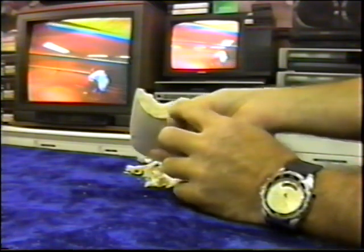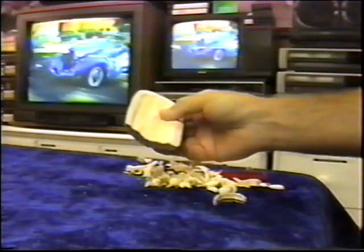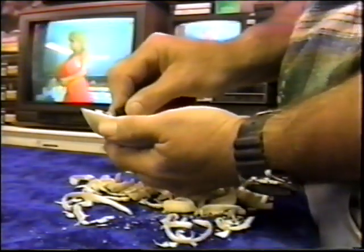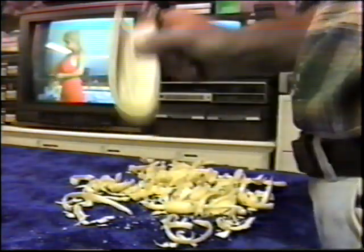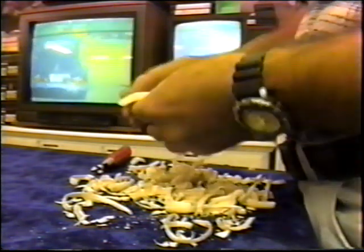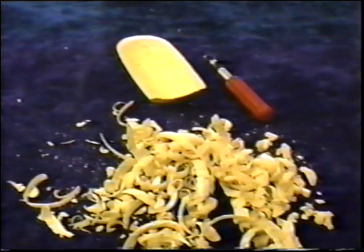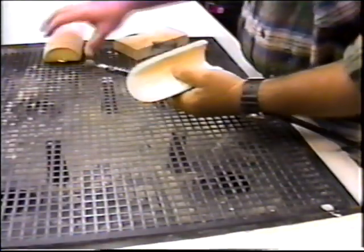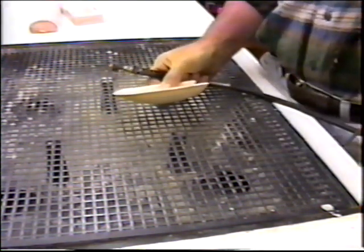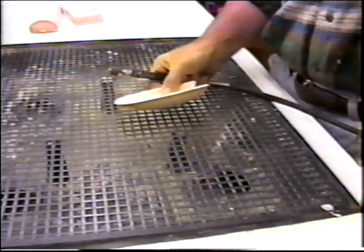And see, I'm going to work my way right down into the nose ring and then pull the rest of this material out little by little. Small shavings are the answer. Okay, the rest I'm going to do with the Dremel tool, the sanding drum. The best way I know of to do this with a sanding drum is to really use a low speed, adding the variable speed. If you try to do it at a high speed, it really doesn't work as well.